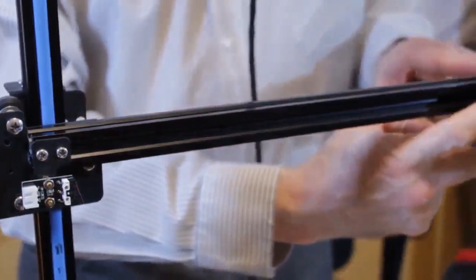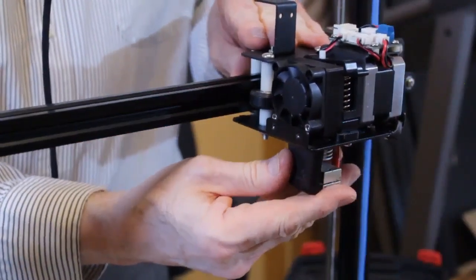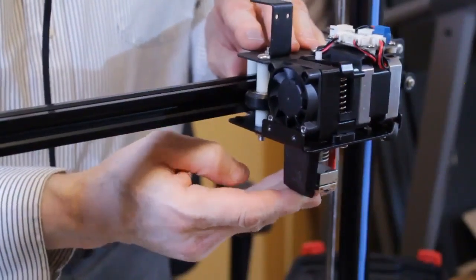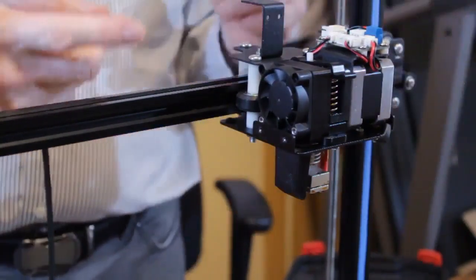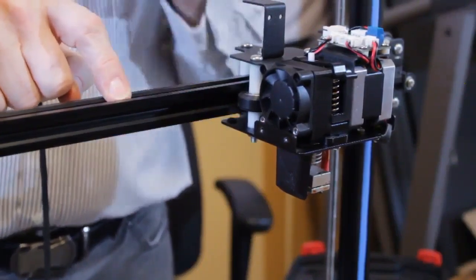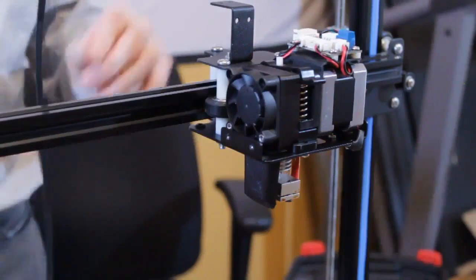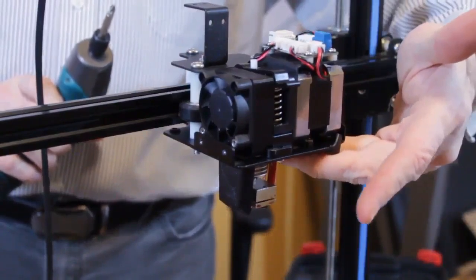So now you can see the rollers. We're going to get these rollers to roll on top and bottom because when they loosen in this position, they create this rocking motion. The slightest slip of any of these screws will allow this rocking motion, which makes it difficult to get a clean, crisp print. Once they're on top and bottom, gravity will hold it down into the V-slot. And if it loosens a bit, it won't be quite as affecting the print. So we're going to remove the extruder assembly from the tray it's mounted on.